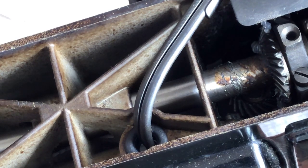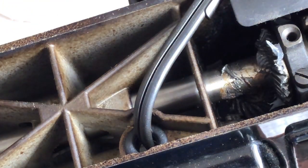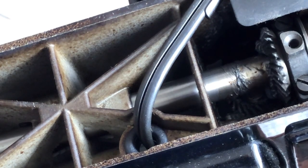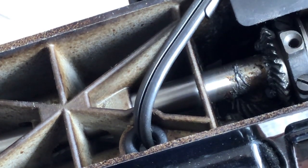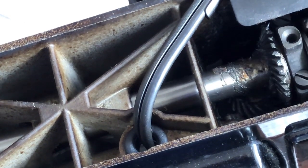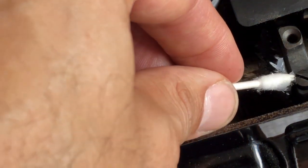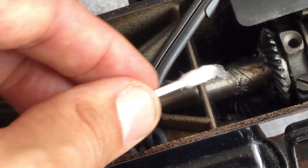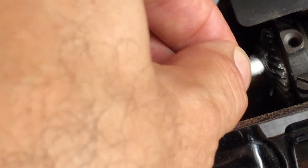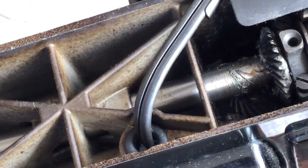What's happening is, as I turn the gear and later as the machine gets tested, the grease I'm putting on this gear is going to come in contact with the lower gear. So I don't need to reach down and put grease on that gear — it's getting on there now as I turn this. I've even got a little excess; I didn't need that much. You can see some old grease coming off, pushing out the old stuff.